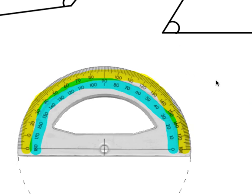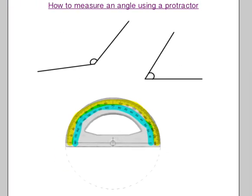So why the two measurements? If we look at these two angles, just like the protractor having measurements from zero to 180 degrees starting from the left, this angle here opens from the left with one arm starting on the left and closing on the right hand side. To measure this angle we would use the measurements beginning on the left hand side of the protractor, starting at zero and measuring to where it finishes on the right hand arm. If we look at the other angle, it opens from the right, going from the right to the left hand arm. On the right hand side the scale starts at zero and goes all the way around to 180 degrees.